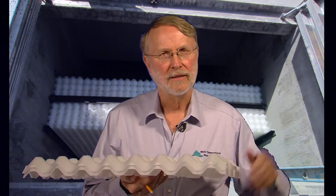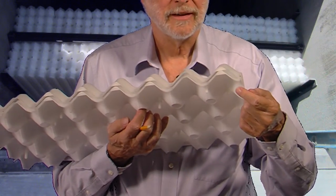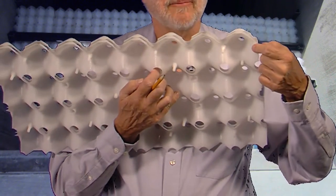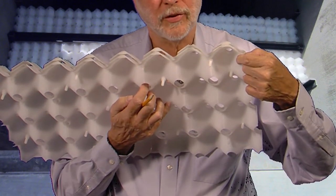These are a couple of typical coalescing plates from a coalescing plate separator for removing oil from water. How these work is that the oily water passes through the plates horizontally, and as it does so the small oil droplets — and they're often very small, 20, 40, 60, maybe 100 micrometers — rise up and meet the underside of the plates.